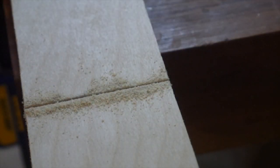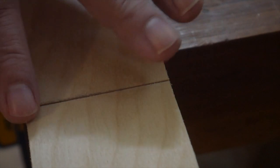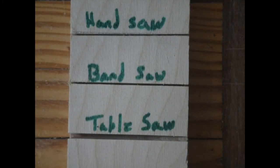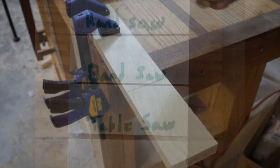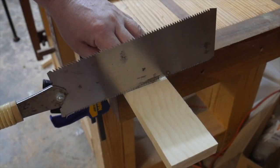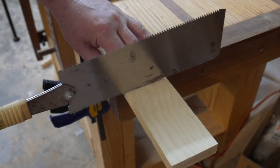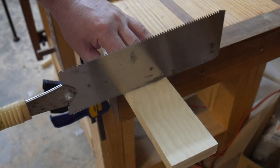However, the saw blade by design removes a certain amount of material when you cut. This is called kerf. Depending on the width of the blade, the kerf might be a fair amount of material, but as long as you consistently cut to the line, your measurement should only vary by about half the width of your blade, or about a 1/16 of an inch or less.